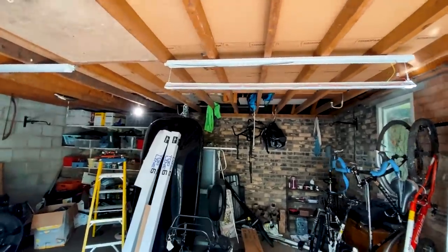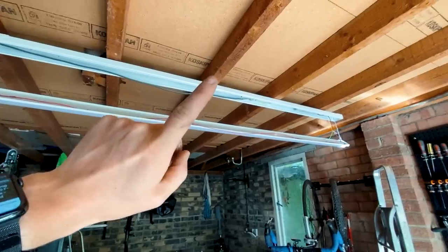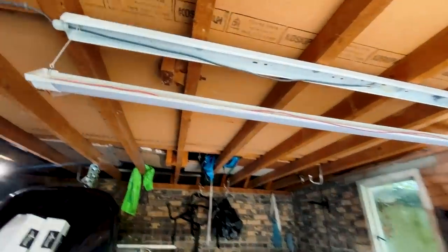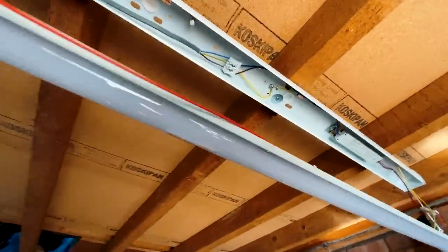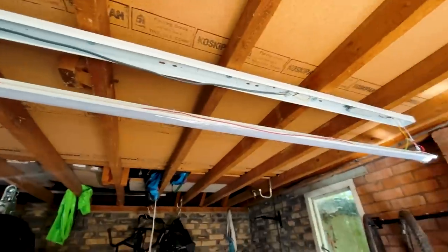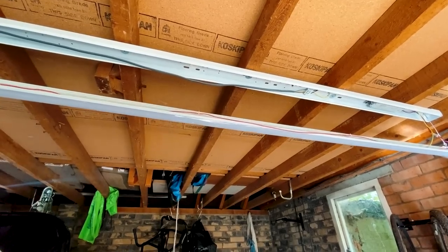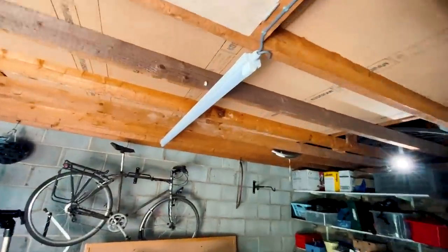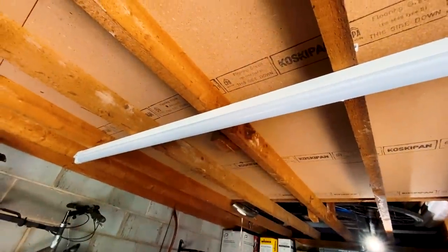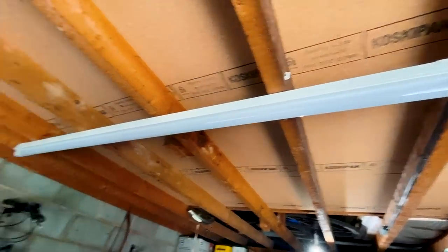We're getting there now — two light fittings are up. The cable comes into the first one and out into the second, which is end of line so I've left the cover off that one for testing before livening it all up. They're nice fittings — they've got push-fit connectors in here and there's plenty of space. They're really nice and bright, basically just an LED strip inside this cover with an LED driver inside, really reliable. You get different sizes — 4-foot, 5-foot, 6-foot — in single and twin versions. You can also get IP65-rated versions with an opal diffuser, but in this case I just chose these open ones.